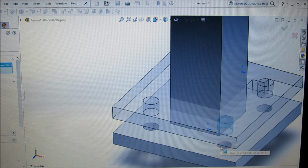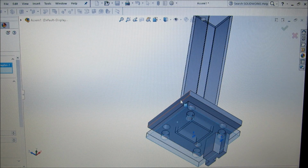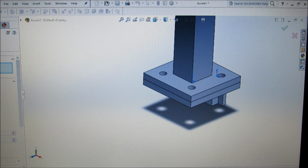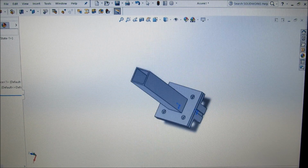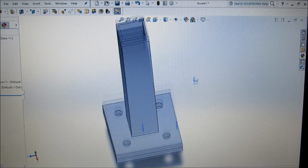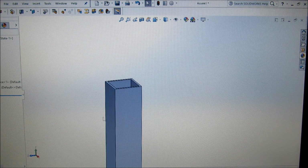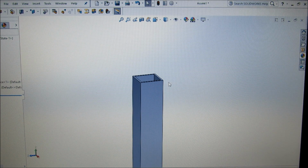We'll do the same thing because in almost every case except for spherical parts you will need 3 mates to hold an object fixed in 3D model space so that it doesn't move around. Anyway, that's basically what our adapter is going to look like, and then there'll be a large structure that comes out this way so that we can support the whole camera. Now I'm going to take care of building the angle in the next piece.